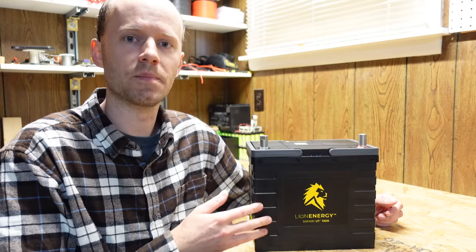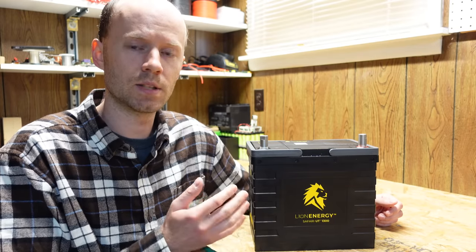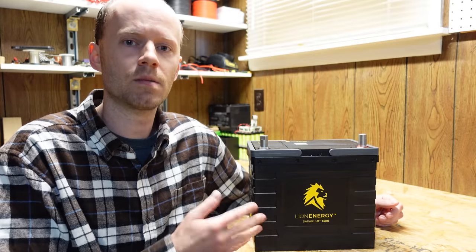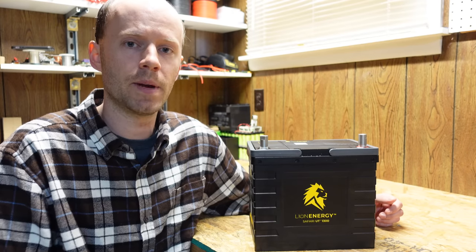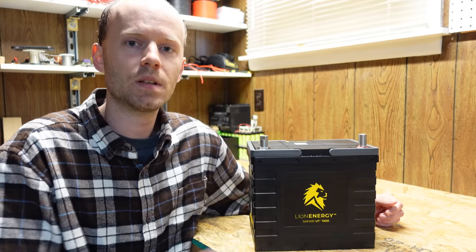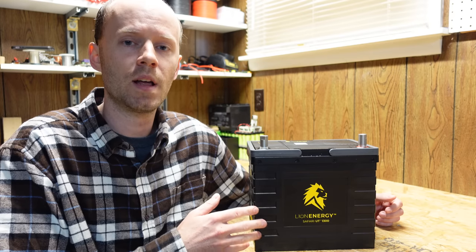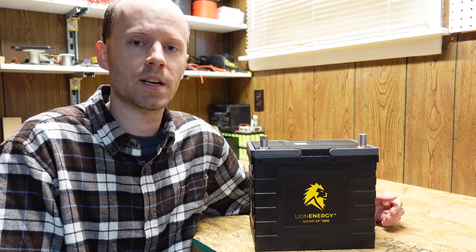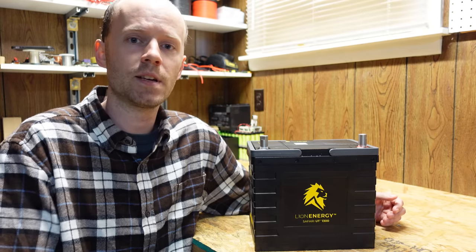So this gets an A plus in my opinion. We finally have a battery that works as advertised — it met and exceeded the rated capacity, the build quality was fantastic, the low temperature disconnect works, and the terminals are of adequate size. I have nothing bad to say about this battery. Now I did test it at a 0.2C rate — if you tested it at a higher discharge rate you might see a little bit less, but I like to continue to use 0.2C rate so I have a basis for comparison across all of the batteries that I test. This battery does sell for $999 brand new, but there will be a referral link in the description of this video — if you choose to purchase one, that will take $150 off that price. I want to thank Lion Energy for sending this battery out to me for review. If there are any other batteries on the market you'd like to see me check out and test, please let me know. I do have one more coming up probably in about two or three weeks. Let me know what you think, hit that like button, and thanks for watching.